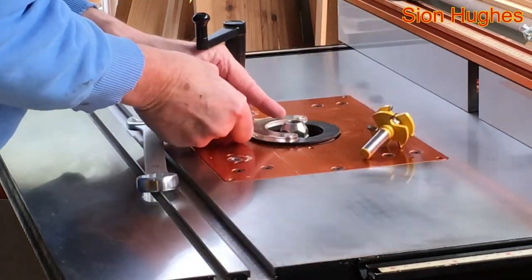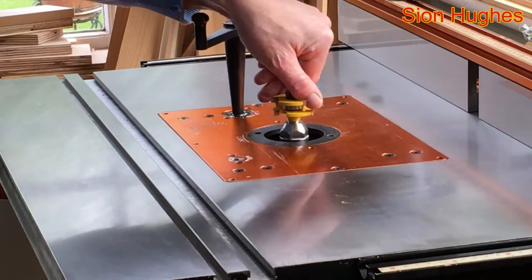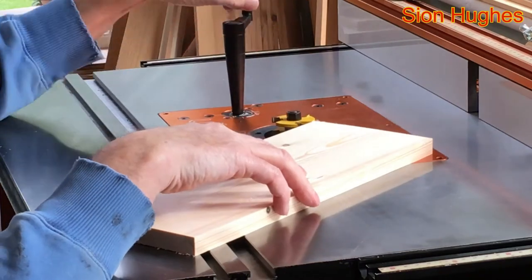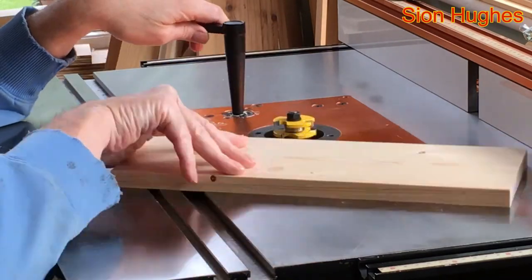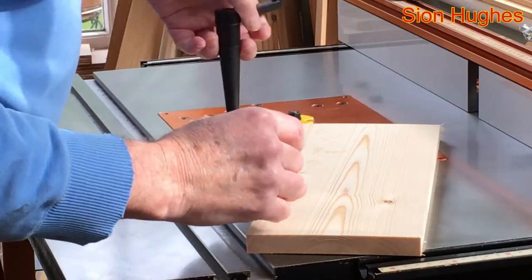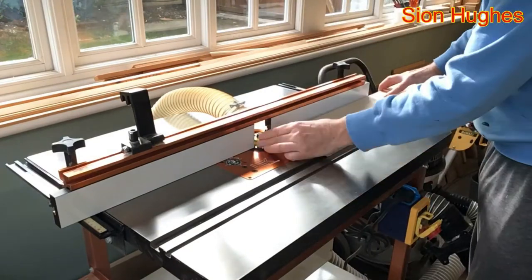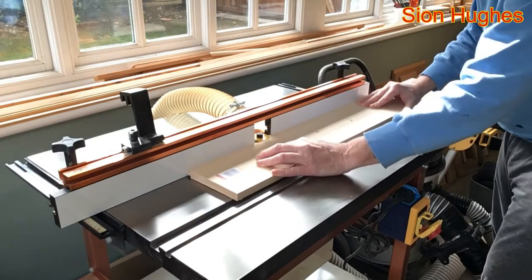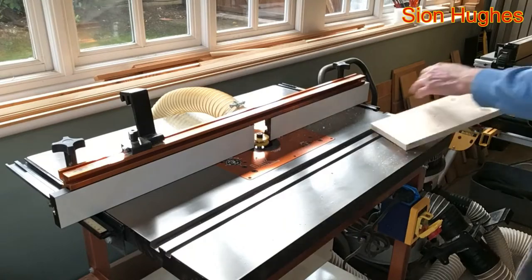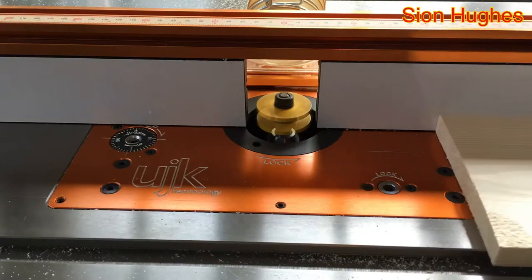I put a wider throat plate in. Now these boards, like every board you buy from the hardware store, will cup - so I want to get this done relatively quickly. Even though I can micro-adjust this router table up and down to a fraction of a millimeter, you never get it exactly right, so I need to make sure all the boards are cut with a dedicated upside and downside. Every time I'm using the router I'm making sure the fence is flush with the bearing. And there we are - a nice tongue. Rinse and repeat for two or three of the boards.